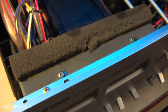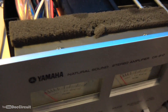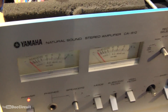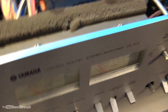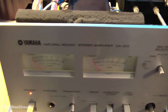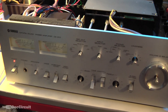All finished — and does it work? Yeah, it does. Of course I tested it much earlier on so I knew it would work. One thing to keep in mind: those lamps are wired in series, so one out means all out. If you're going to open it up to replace just the one bulb, you might as well replace them all. It is a bit of a faff to get to them, so it seems a false economy to replace only one — better to start fresh with a whole new lot. Anyway, that's one fixed Yamaha amplifier — until next time, bye for now.